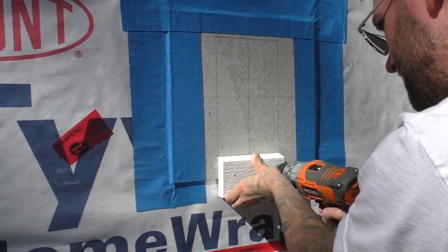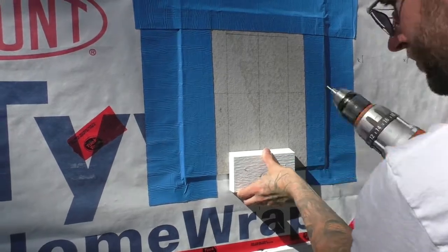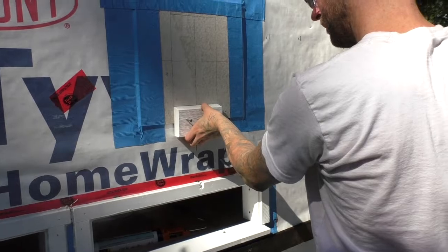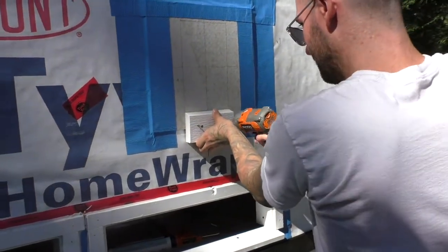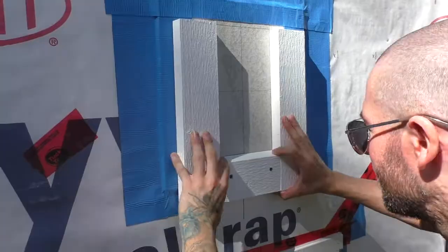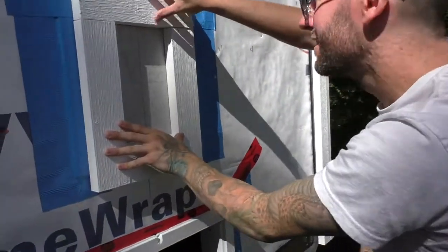Trimming around the cement board was unique but not much of a challenge. The cement board stood the trim out from the wall an adequate amount. You'll also notice here that the little storage doors have the same brick mold deal going on as the main door, but they needed some extra work. They required me to build a jamb from scratch.